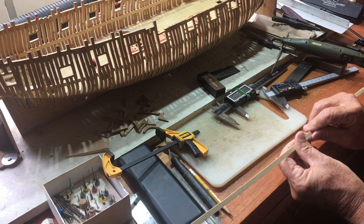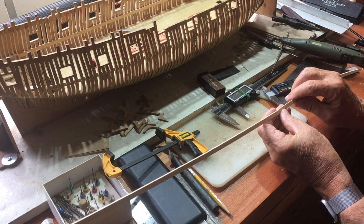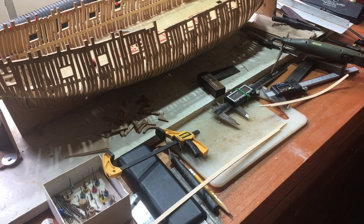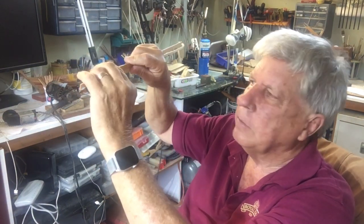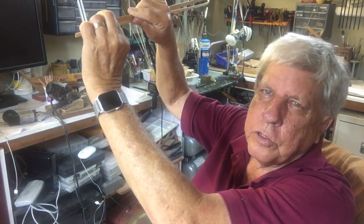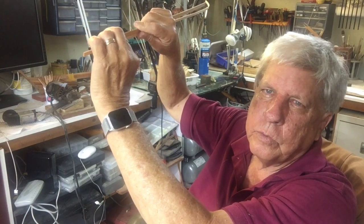You can see it's not a perfect join, but it's a join nevertheless. We're now going to clean up further using our chisels. Before you do that, you need to hold up the two pieces — let's assume these are the two ends — close together and hold them up to a light or to the sky. You should be able to see no sunlight through the join. If you see sunlight, that shows you where you have to trim.